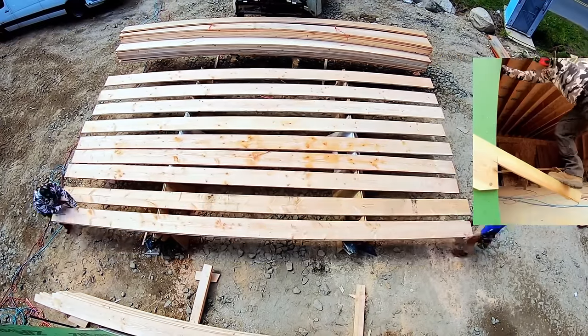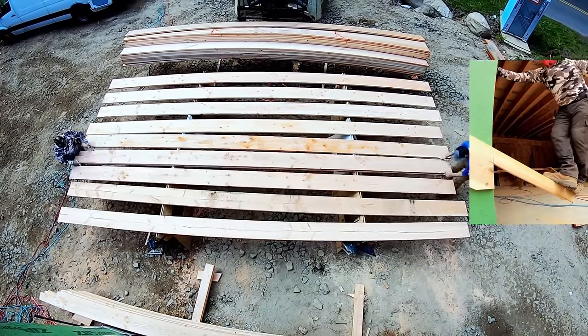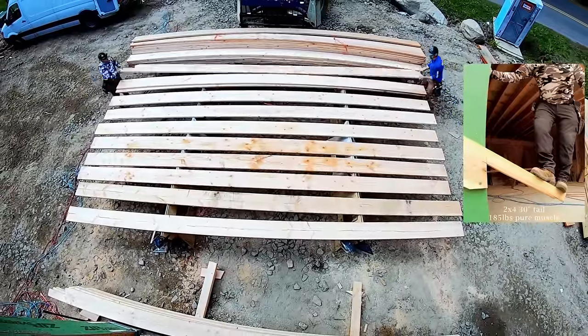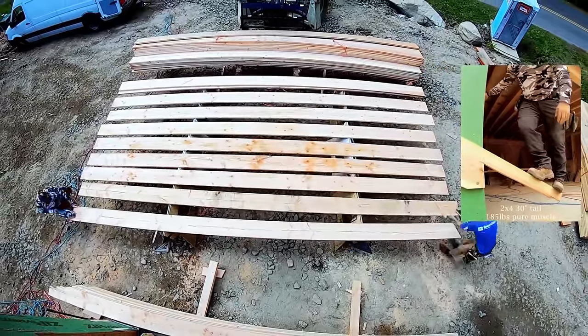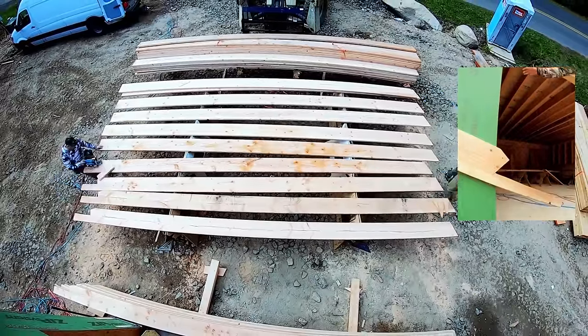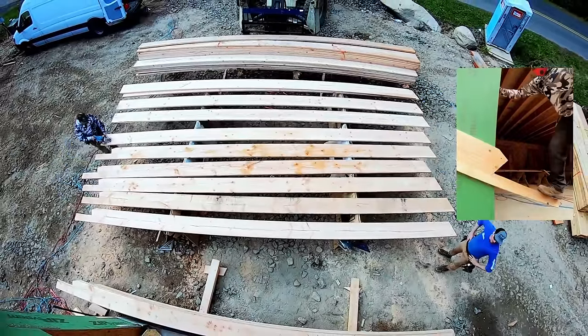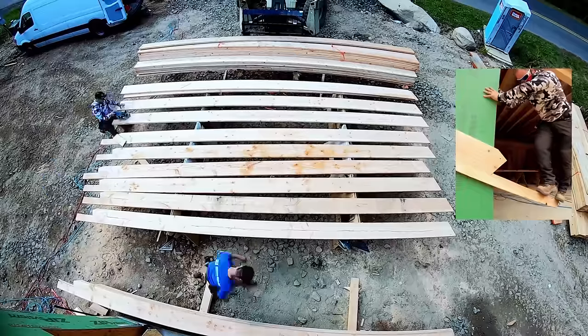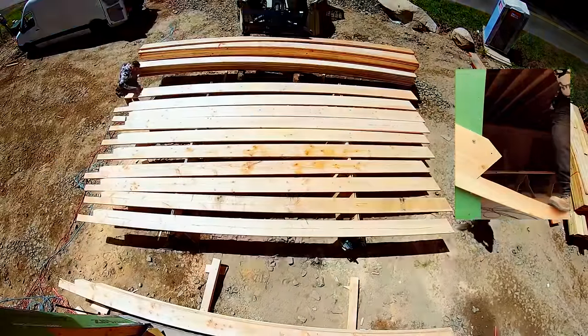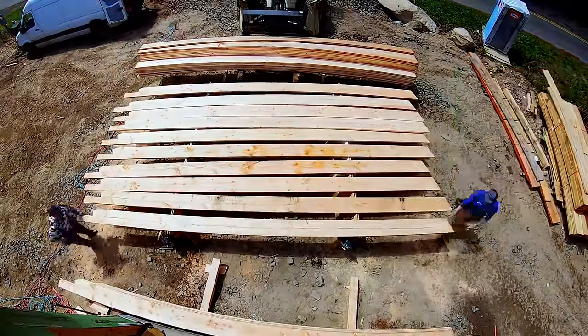Take a rafter, maybe cut a 3-foot tail. Overcut it so the scrap falls out. Take that rafter, screw it to a wall so the tail's about a foot off the ground. Now go stand on the end, balance and bounce on it. You're not even gonna hear that tail crackle. It really is quite amazing, and I do recommend doing that. I've done that and posted it on Instagram. You can go check it out if you'd like, or just do it yourself. It is pretty eye-opening.